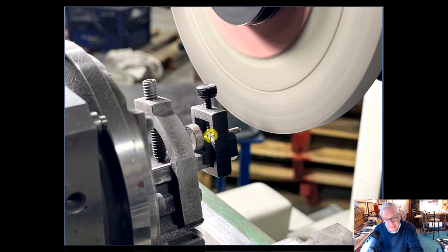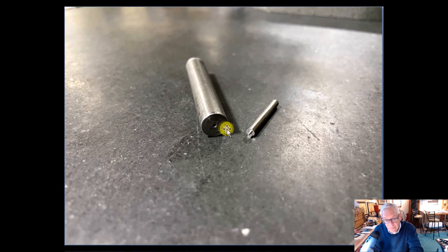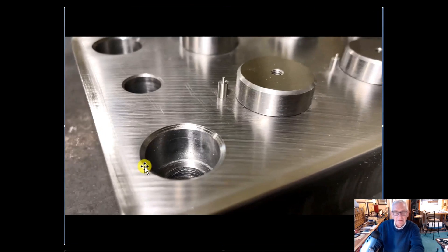Here's another view of it now that it's done. I wanted the longer pin to have something to hang on to, and I put a little magnet at the back for a stop so I didn't have to pick up each one. They all came out within a thousandth in length. Now, how are we going to pound these things in without bending the 30-thousandth diameter pin? I made a little punch — just drilled a 40-thousandth hole in a piece of 3/8 cold roll. We want to make sure we have the 0.288 stick-out height. That's the finished product.